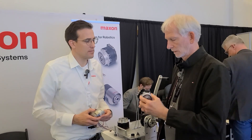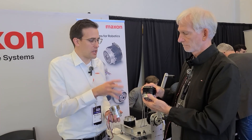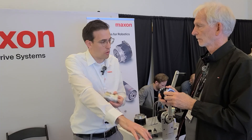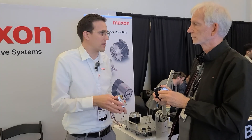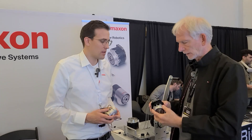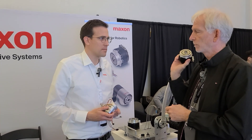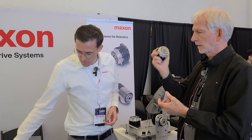The planetary gear is cost-effective — pretty cheap to manufacture but still robust — and you don't have to deal with a hollow shaft, which is an advantage. Nowadays in humanoid robots, a lot of customers say they don't need the hollow shaft; they're not worried about routing cables inside the linkages anymore. Strain wave gears tend to be more expensive and harder to scale up. I'm really excited — my humanoid is going to be so good I'll need to ramp up to a million units a year. I'll need 30 of these throughout my humanoid — how hard will it be to produce 30 million a year?